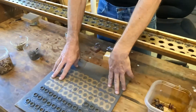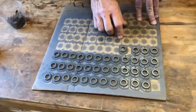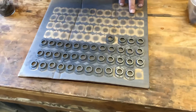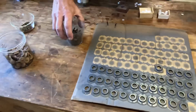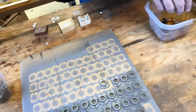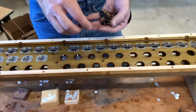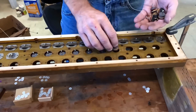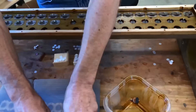Here we have all the valve seats. They have been lapped on a piece of glass with very fine emery cloth to make sure they're completely flat and smooth, and then I've sprayed them with McLube, which is basically a mold release, and that makes them very slick so the valves will seat properly. Then we have the valve guides, the screws, and of course the buttons that we won't be putting on right at the moment. The first step is to go ahead and load our valves into the valve well and put the seats in place.